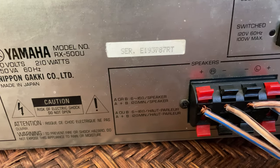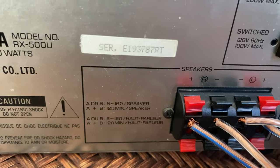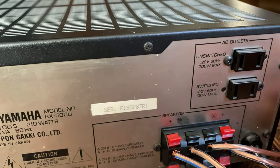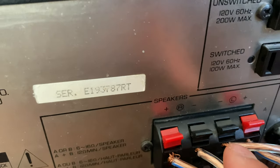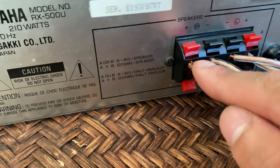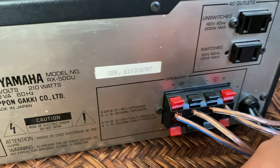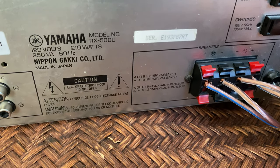I'm going to send you a link to some speaker wire you should get — that will improve the sound. What's in there now is like lamp cord wire; it works fine, but as you can see there are exposed wires and that's not good because over time they'll corrode, and they also have the potential to touch each other. You don't want positive and negative signals touching while the amp's on — it'll short your amp out or blow your speaker. You want everything to be separate.